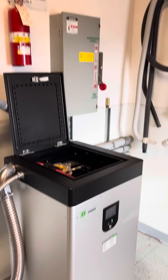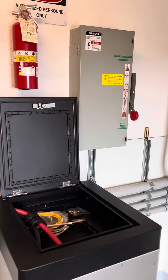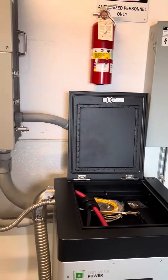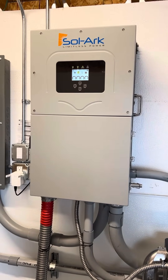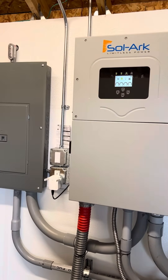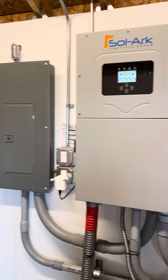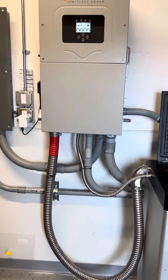We have solar outside — some on top of this building and a couple more on ground-mount poles. What's nice about this solar converter is you can add a ton more solar: there are three MPPTs with two inputs per MPPT. Right now we've got two pole mounts and one on top of the shed, so we're using all three MPPTs to maximize the output of the solar panels.